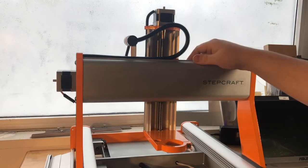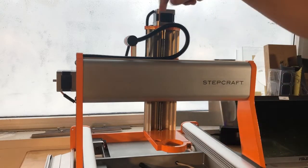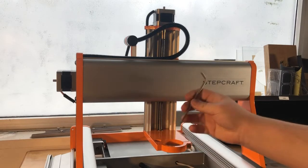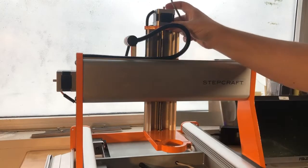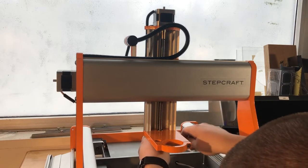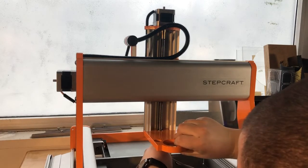If we can't get it moving with software, there's a simple step we have to go through — even if we can get it moving. That step is just loosening the two M6 bolts at the top plate and the three M6 bolts under the spindle plate. You just need a number four metric Allen key. Simply loosen them enough so that you can rock this back and forth — the piece that holds the motor, the top plate. We want that back and forth movement, not up and down, then do the same with the bottom plate.